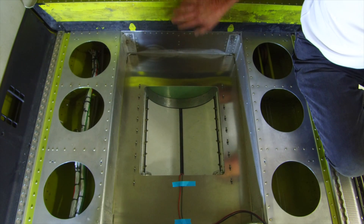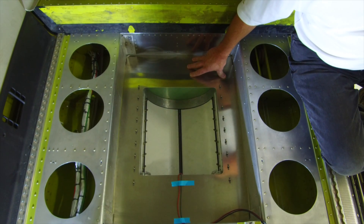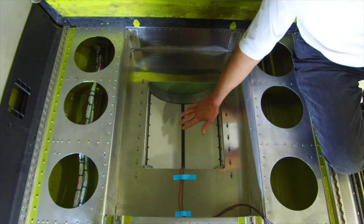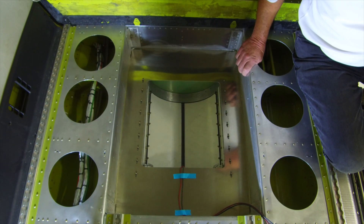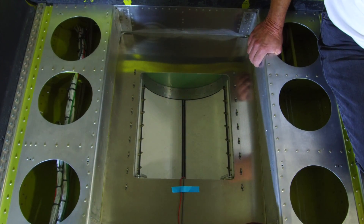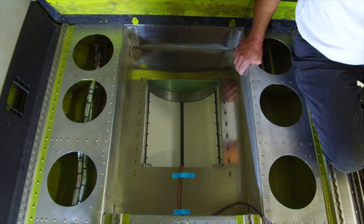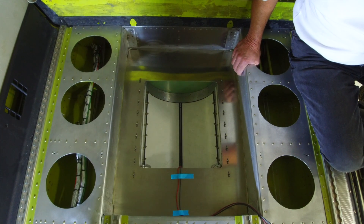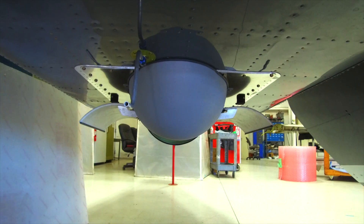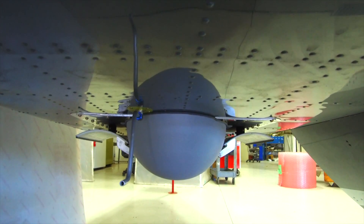This is a prototype camera pod mounted on an adapter plate which is bolted to the floor of the camera bay. We have 15 inches available here, 14 inches across, and a depth of 7 inches so we can get that camera lens well down to the belly of the aircraft. The camera pod will be mainly made of composites and stainless steel to minimize any corrosion problems from water spray underneath the belly. It's electrically operated and the doors open up completely until they touch the belly of the aircraft, minimizing air turbulence in flight that could potentially disrupt the camera lenses.